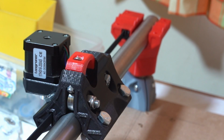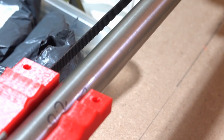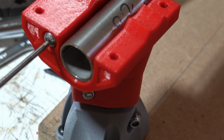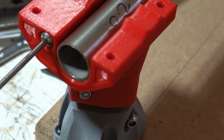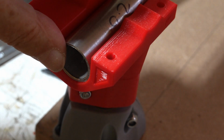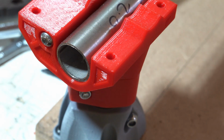There, and I need to do that with a 10mm belt for all 4 axes. For all 3 axes, and all should be tickety-boo. You tighten them with a tensioner and that screw there. So tighten them so that they're nice and tight, not so tight that they play a bass note, but certainly not floppy.